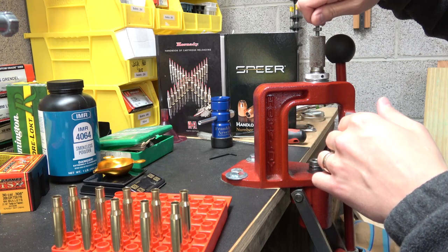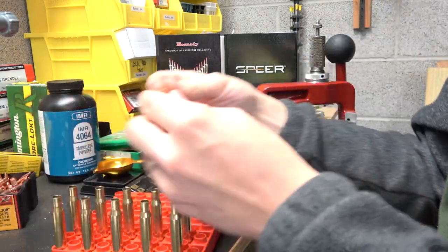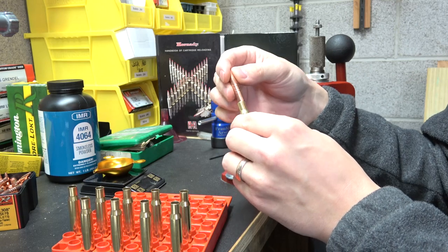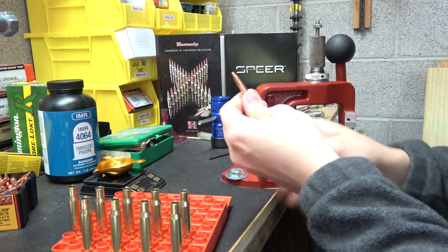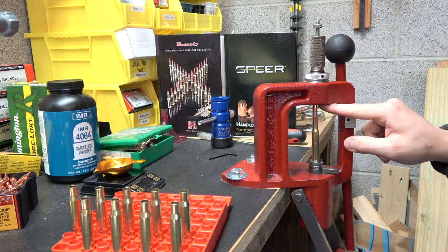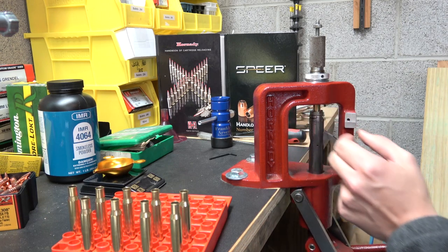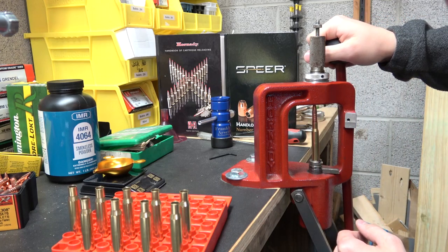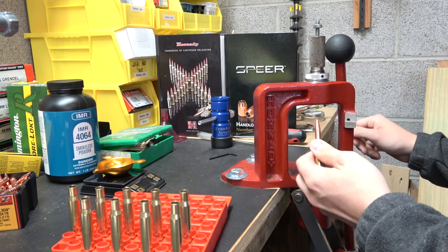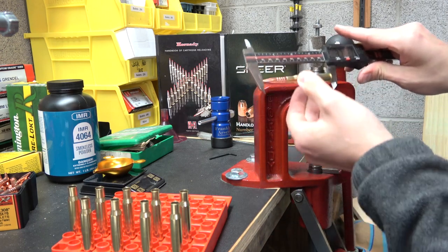Let's back that way out because I have no idea where we're going to be sitting. These bullets are absolutely gigantic, and they are flat base so they're not going to want to seat perfectly — I'll guide it up in there. It's long enough that before the bullet's seated, it's going up into the die. That's seating it a little ways — we're miles long. Let me check: 3.218 inches is what we're going for. We're at 3.7 inches right now.